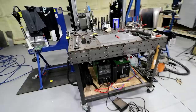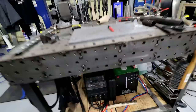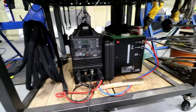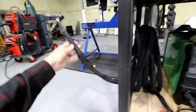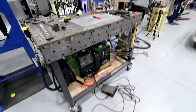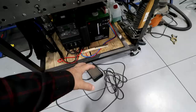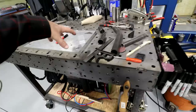Let me show you how this plays out in my shop. Over here I have a CertiFlat welding table — I think this is the 3x4. I've got it set up as a standing welding table. Just under it, I have my Everlast 325 EXT permanently positioned with a water cooler and my upgraded 25-foot torch hanging there. When I'm going to weld right here on this table, I can just take off a loop or two of the torch. I've got the pedal there, and the ground is just stuck right on the table itself. Anything I'm welding, as long as it's contacting the table, I don't have any issues.